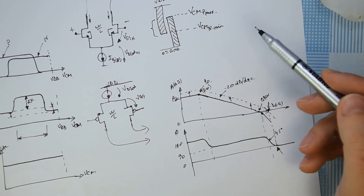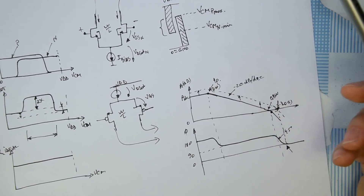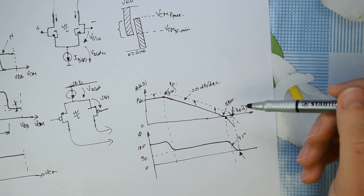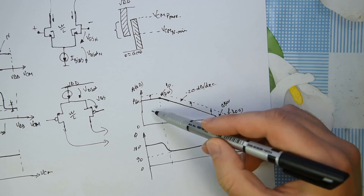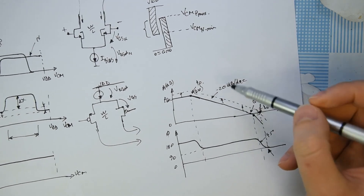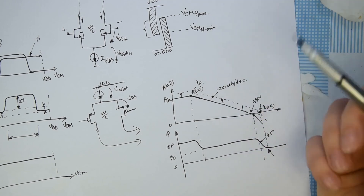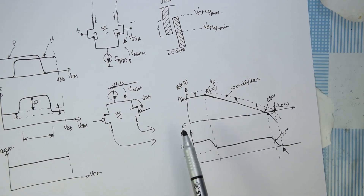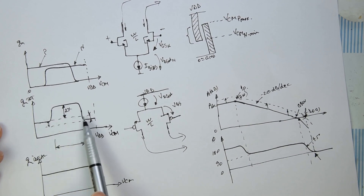This is the reason we want to avoid any over-increase in GM. It's not the only reason — there are also issues with linearity, offset, and noise. But instability is the most visible and most annoying one. You could take large safety margins and reduce gain, but then you over-design and don't achieve maximum performance for your op-amp. In the next lesson, we'll see how to solve this problem and how to make this over-increase as small as possible.